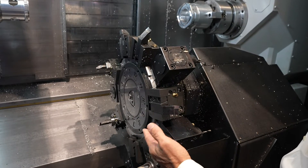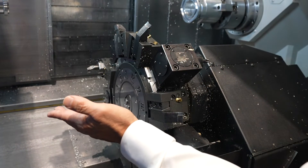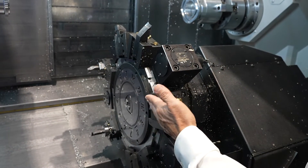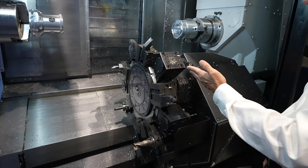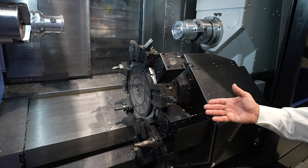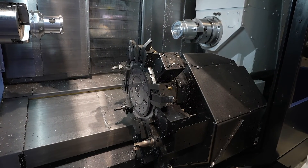The chucks on both spindles are eight-inch chucks. The lower turret on the machine is a 12-station turret equipped to go in either direction. As you can see, you have tools facing the front-side spindle to do all the front-side turning, drilling, boring, and live tooling in the front. On the top you'll see rear live tools to do all the backside work on the sub spindle side with live tooling heads in the Z-axis.